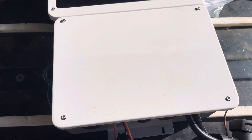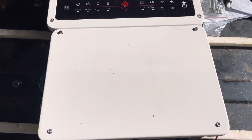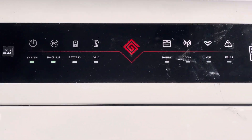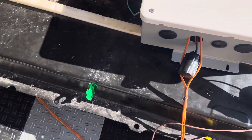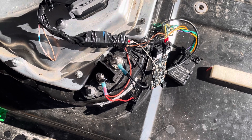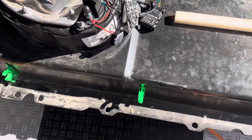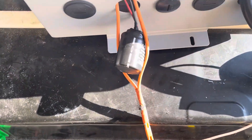Because of their changes, it doesn't actually work with BYD batteries — I wasn't able to get the CAN bus working. But it still works as an inverter; it just doesn't know the charge state of the battery and can't charge it. So I'm using the LilyGO with my custom cable and the BYD battery emulator software running on it.